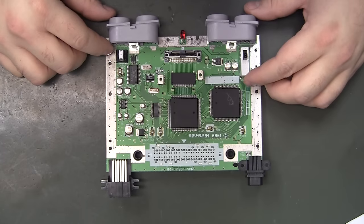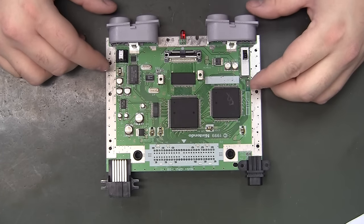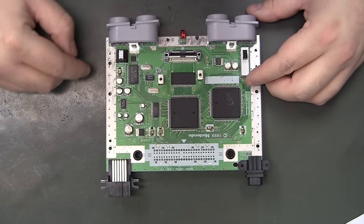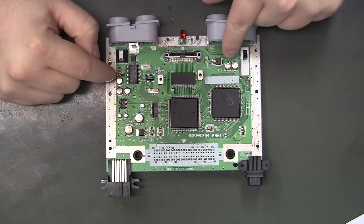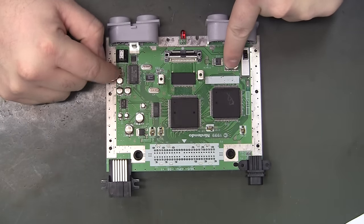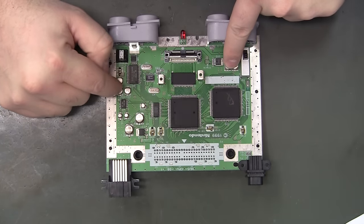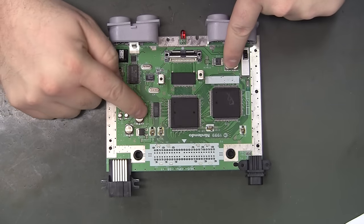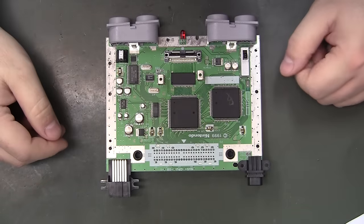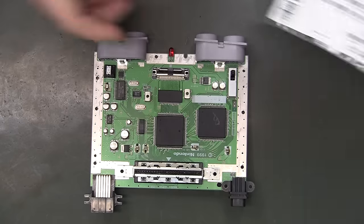I think I'm actually going to go ahead and put it back together somewhat and test it just to make sure everything's still okay. And then I'll go back and do, let's see, I've got a couple more 68s and a 33 here that I know are power rail. And then I'll do the same thing. I'll test when I do each of those three. These four up here, the analogs, there's no reason to test that. I'm replacing electrolytic with electrolytic. So, yeah. Well, the test was successful.